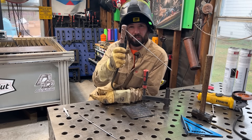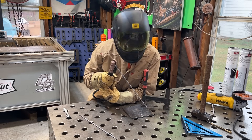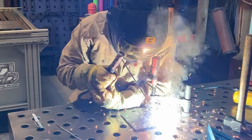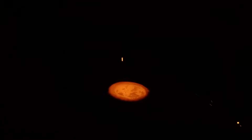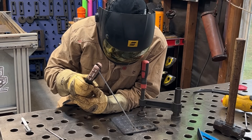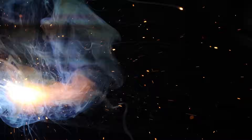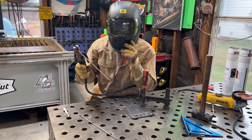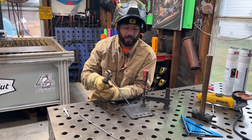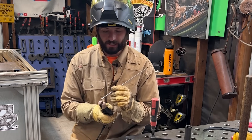We're going to start with the 6010 rod. I've put the electrode at 45 degrees down, since I'm working in the flat position so I can hold all my angles without holding my elbow way up. Strike an arc, make a puddle about the size of a dime, and let go. Strike an arc, size of a dime, let go. I want you guys to pay close attention - I'm starting right next to my dot and when I swipe next to it, I barely have to touch that material. I know where the clean spot on that electrode is and I only need to make that quick little swipe. I'm not flicking up - I'm barely grazing the surface, then only a quarter of an inch max away to get that started.